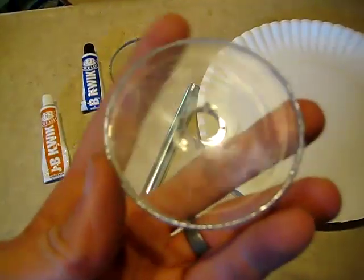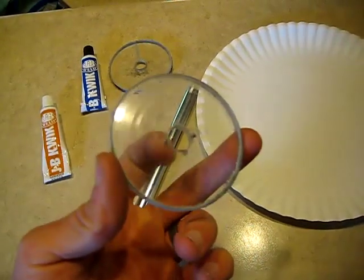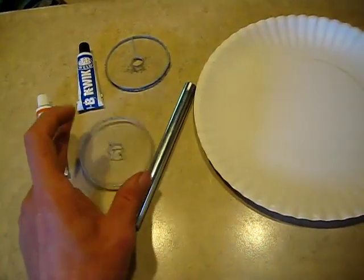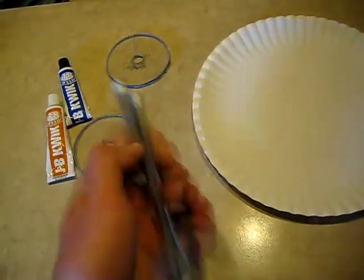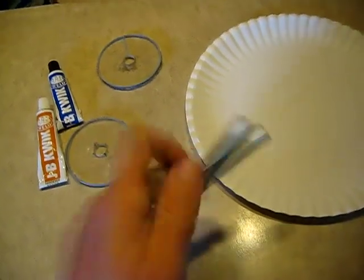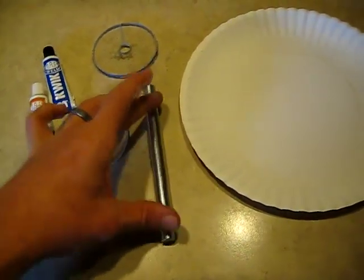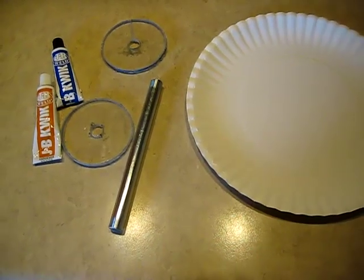You can see I've pre-drilled some holes here for the beginning wires — the wires that first begin to wrap around the coil. I've got some JB Quick here to glue these on. One quick note: rough up the ends where you glue those on with some sandpaper. You need to really glue these on securely because they're going to want to fall off, whether while you're building the coil or later.